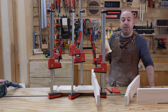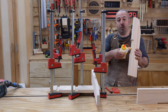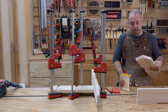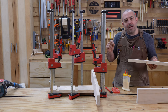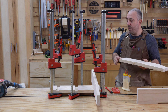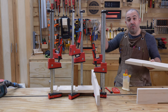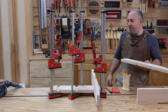Let's glue this up. This should be all that you need — you shouldn't need to add any screws. Make sure that when you're doing your glue-up, you glue not only on the dado surface but also on the two sides, as well as in your groove and on the sides of the groove before you insert your shelf. If you do want to put screws in, just make sure you do a countersink bit on the back. I'm going to go ahead and just glue it and clamp it up on my parallel clamps. The parallel clamps are flat so everything's just sitting on here, and I can just drop them down without a rocky balancing mess.